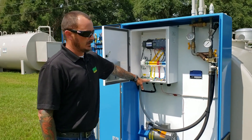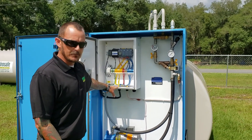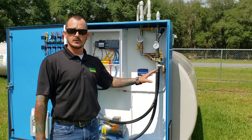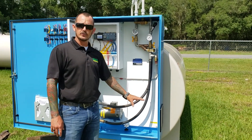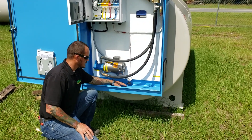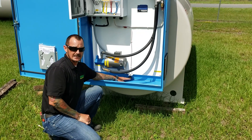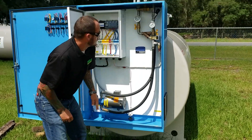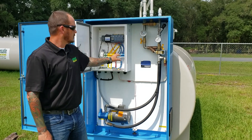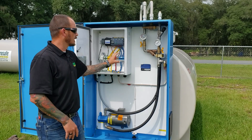This is going to be your panel. Never at any point in time should you ever bring power into the bottom of the panel. The reason for that is in the event that there's a leak in any one of your hoses and you have fuel, it'll go down to the bottom of the panel and you don't want the fuel leaking out. If you look down here, there's a little float on the bottom of this transfer system. Once this raises, an alarm will go off indicating a leak. There's a light on the front and inside the actual control panel is a display function that will tell you there's a leak inside the panel, and there are different alarm functions.